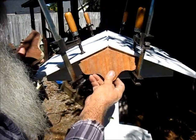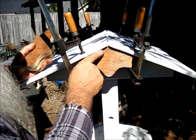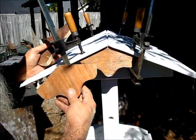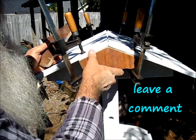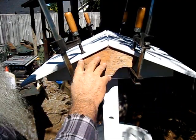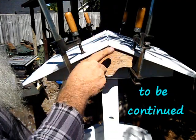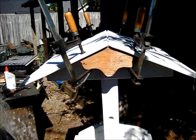But anyways, I put him right in yonder like that, and I did do both ends before they glued and clamped. And I did do both ends because the nature of woodwork, you can move it ever such a slight amount to where you find that it fits the best. And that's what I did here. And I did make some marks and measurements, and it did come out pretty close to exact measurements. But like I say, that's been glued, and what I'll do is I'm gonna nail that fast, and then I'll put a primer coat on it. And this one's just about done.